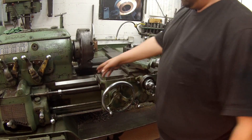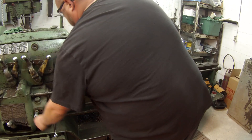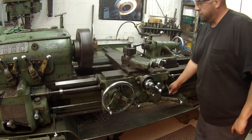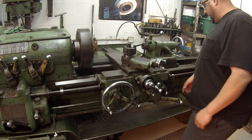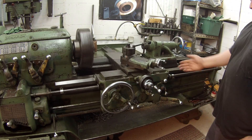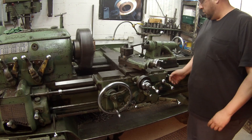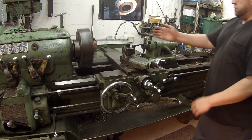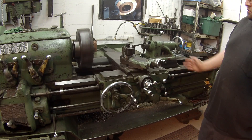I'll do one more quick example of this — we'll use the lead screw instead of the feed rod. The lead screw's turning behind this rod so it's hard to see, but we're going to go ahead and engage it. I'm just watching my thread dial here. You're threading, you're going down. You pull it up to neutral to stop it — you don't have to disengage your half nuts. Pull it all the way up to reverse, you can let it come on out. Clear your part, go to neutral, readjust your cross slide, drop it back in and keep going.